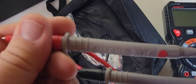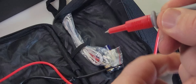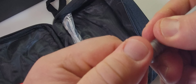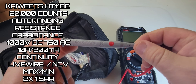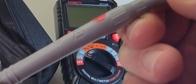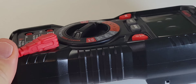Test leads have a really nice size — full size for a full-size multimeter. Cat4 600 volts. They have that nice little safety shroud at the tip along with holders for getting a good grip. Really perfect in terms of a test lead. You can take off the cap and lose a CAT rating but gain better access to whatever you're probing. They are not silicone — standard PVC — but they do feel really nice with good stress relief on the end. Nice, solid, snug fit with the shroud into that input jack. It ain't going anywhere.